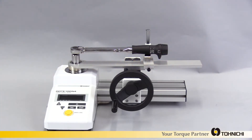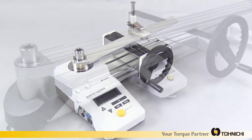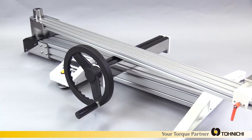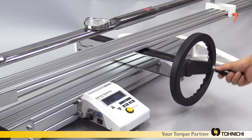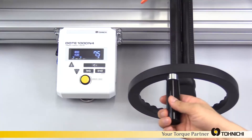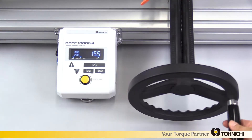The DOTE-4G model is a calibration tester with horizontal loading device, pole and pole holder. It is a high accuracy measurement tester. There are six models covering a torque range from 2 Newton meters to 1,000 Newton meters with plus/minus 1% accuracy. The newly designed wheel handle with bearing mechanism turns smoothly and reduces the burden on the calibration process.